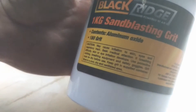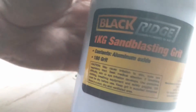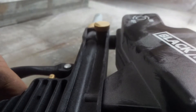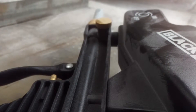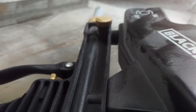I'm assuming the garnet grit will take more off. I only bought a small amount since I just needed a little. On your sandblasting gun, there's a little dial where you can adjust how much medium to release. I've got it just barely open so it's spitting out just a little bit — you don't want it open too much or you'll waste your medium.